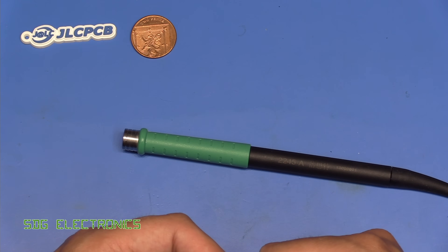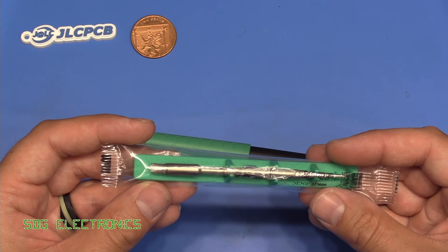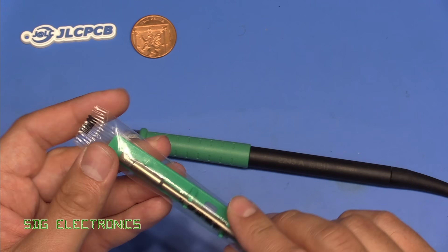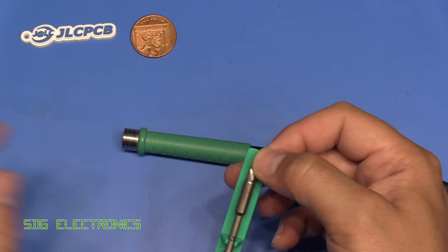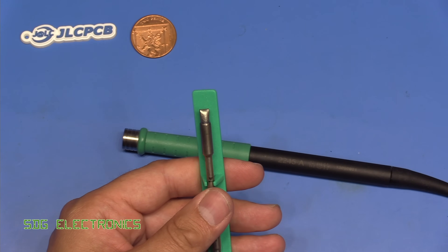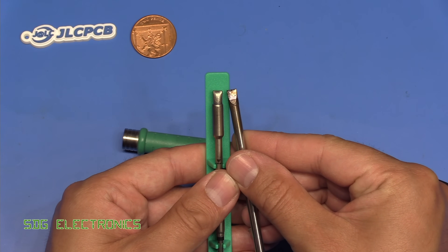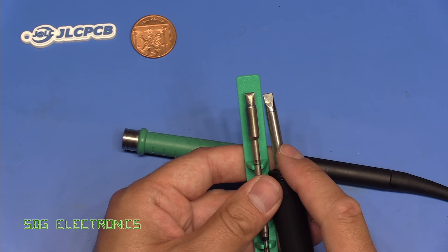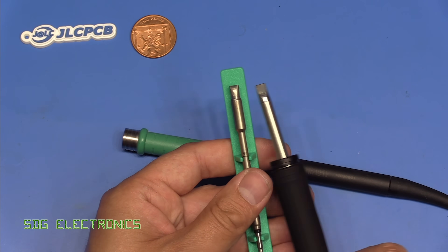On the 2p coin test, I think I did upset a few owners of JBC stations. So I've gone out and bought another tip for it. I was using a genuine JBC tip previously, but it was a little bit smaller than the Metcal tip. I've gone ahead and bought one that is exactly the same size as the tip I'm using in the MX-5200 — so 4.8 millimetres — and similarly the same on the GT120, which I think might be 5 millimetres rather than 4.8, but that won't make any real difference.